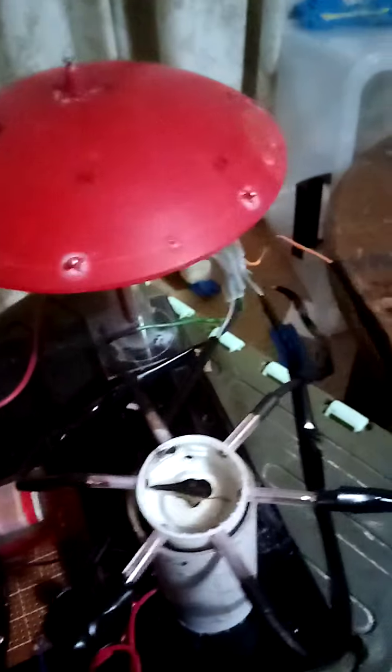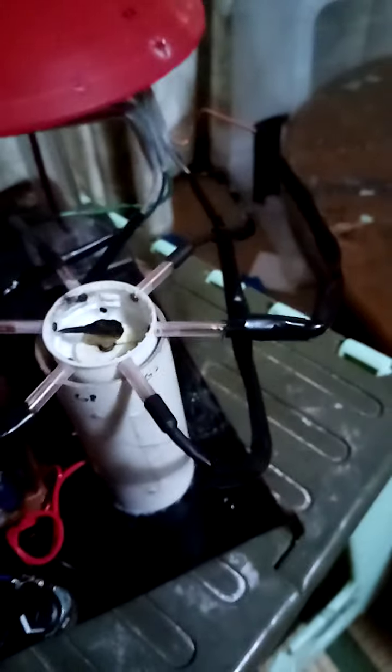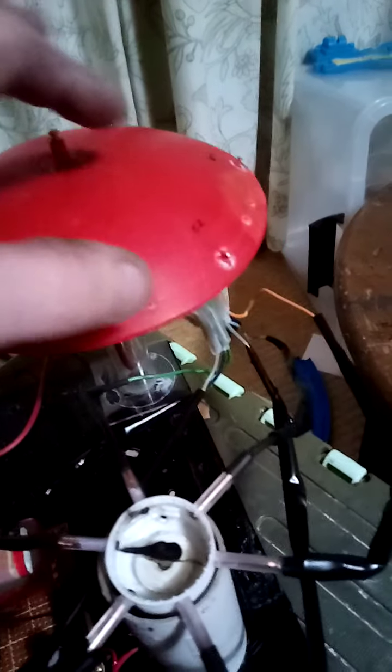This is the setup I have now - these are the negative electrodes and this is the positive electrode going straight up through that plastic tube, which is glued in. All of these wires have a plastic insulation around them, and they do need some type of insulation - not because they're inducting each other, but because they're ionizing the air and losing a lot of electricity that way. But all in all, having these wires close together doesn't seem to affect anything.